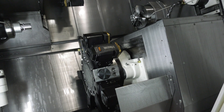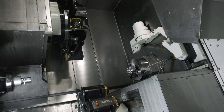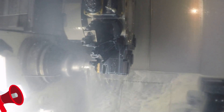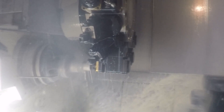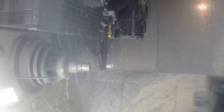On the hardware side, we use linear guides for increased speed, and the turret has a 0.2 second index between tool positions across 24 different positions. That 0.2 second index is a straight index — you don't have to push out, move to position, and then reclamp. It's a straightforward index.